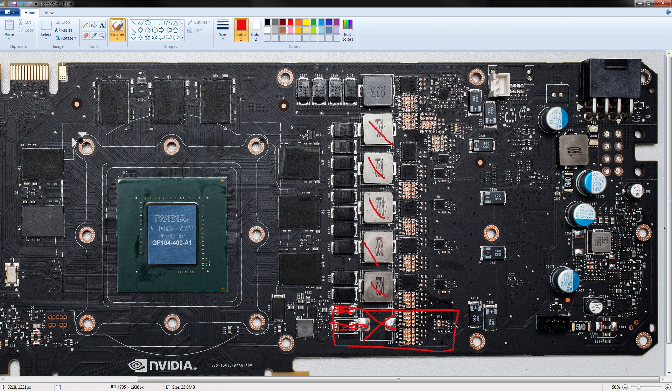Other things they left out: there's one set of MOSFETs missing for every VRM phase. So every phase currently only has one working MOSFET, which are these black blocks here. This is a Dr. MOS — some fancy name — and basically this is a circuit that integrates both the high-side and low-side MOSFETs into one IC, one chip right here. This can do 50 amps output current and 30 amps input current — the low side is 50, the high side is 30. So basically you've got 50 amps per phase, because there's only one of these per phase.